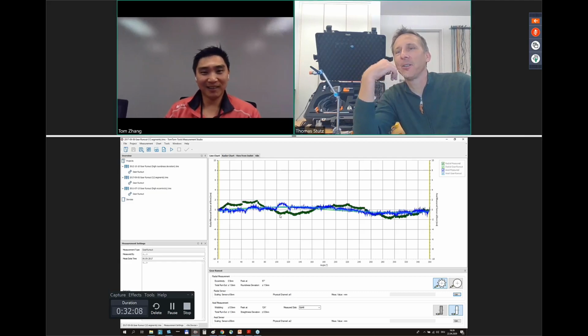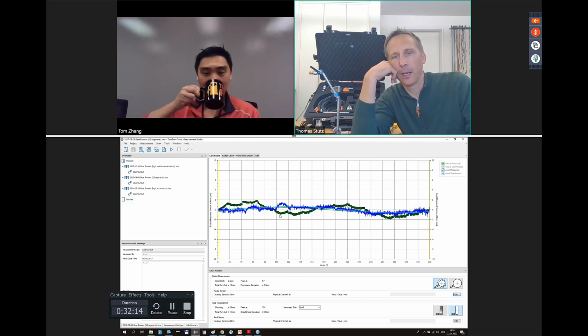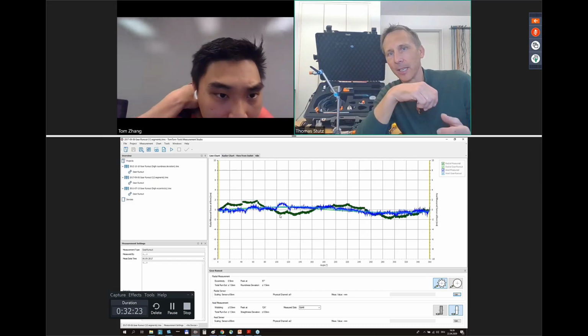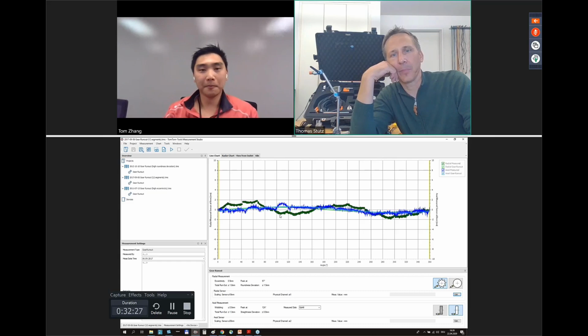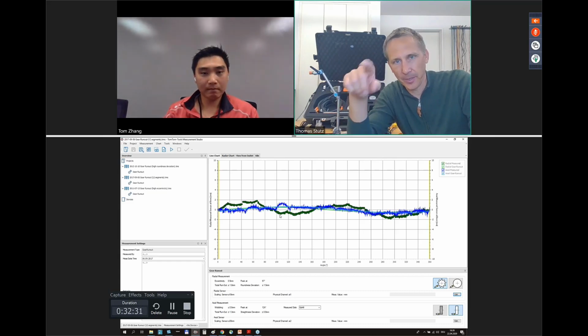Usually on kilns we have two pieces, so the girth gear is made of two pieces because of size and also to install. If it were a single piece, a single ring, then we would have to cut the kiln to place it. So that's why usually the gears are made of two pieces. But this example was on a kiln and it's made of 12 pieces.